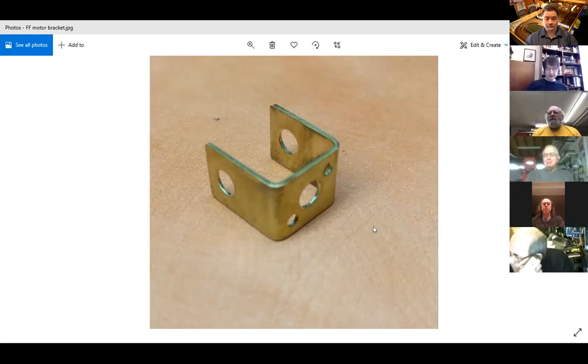So Dennis, do you just solder to the sides of them, I guess, or underneath? Is that where usually you have the attachments? Yeah, the side rails would go along the edge here and just be soldered straight onto the edge there. I haven't got my photos on this computer. I'm so sorry, folks. Because you're putting the rail underneath that, right? Yeah. Well, there's a cutout on those brackets for that, which fits perfectly. Now, mine you would put on the outside. Gotcha. And if you wanted to put them on the inside, you could cut a little groove there as well and put them on the inside. I do that on the 3/4 wide ones sometimes. But if somebody wants them wider than 3/4, I can make them wider as well.